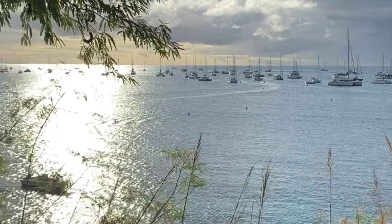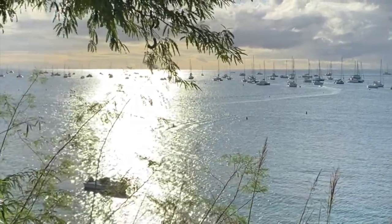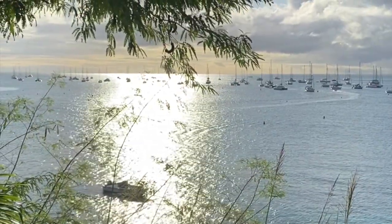cleaning the strainer. Also, it's to keep toilet waste and grey water waste in the boat, because you're in an area where you don't want to put grey water or especially wastewater into a bay like we're in at the moment. Also, if something happens to the system where the pipe splits and water is coming in, you want to be able to stop that as quickly as possible, so you can switch the stopcock off, and that will stop the water coming in, and then you can deal with it as and when.